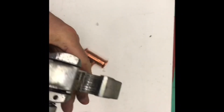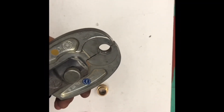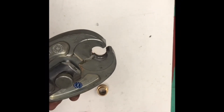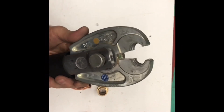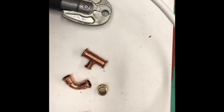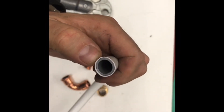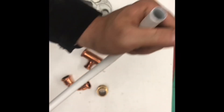Moving on to the composite one — same principle. This is a U profile jaw, so this will do Uponor, Rifeng, Multikwik Multi pipe, Maincore, and a couple of others. Different size — 16mm. This is the composite pipe with an aluminium core: it's got an outer layer, an aluminium layer, and an inner layer. It's 100% oxygen free.